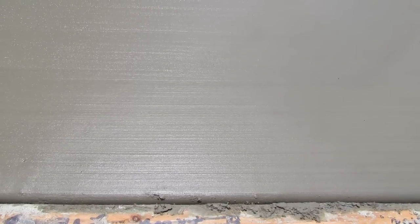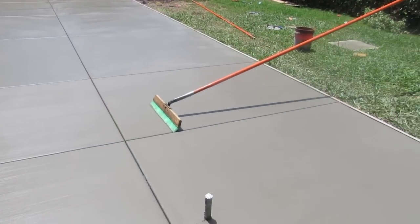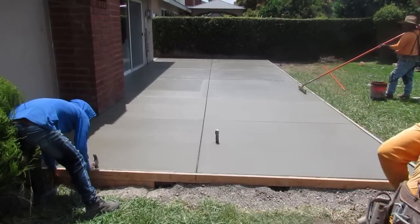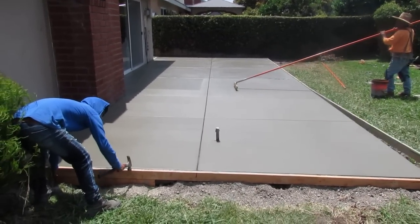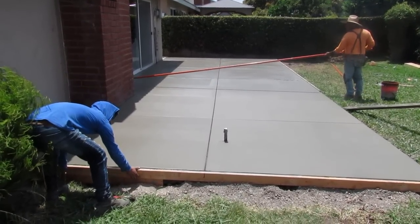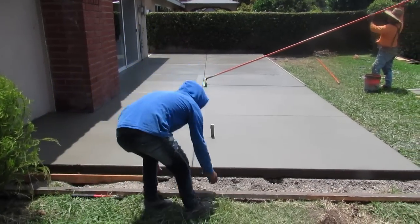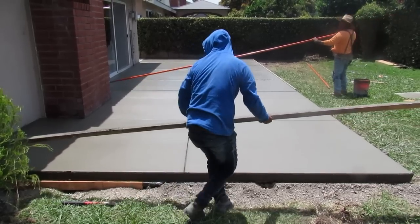You don't broom it too wet either, and you put a light broom on out here. And we're not brooming it wet and just leaving tracks in it. It's got to aesthetically look good. But that's why I'm the best in the West. Because I make sure, hey man, I'll say, go trowel that section again. Look at that, or look at that dip in it. I'm just standing there the whole time, staring at every square inch of it.